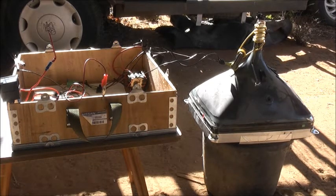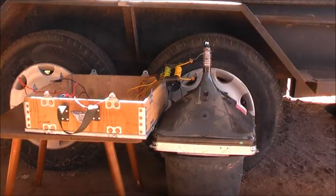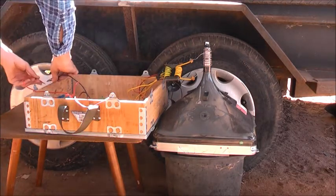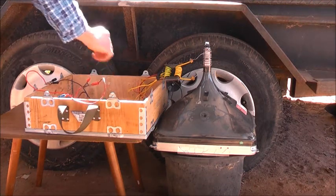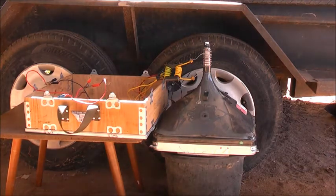It didn't work too well — it wasn't getting warm enough in that electron gun. Confirmation that it is working: it got quite hot on that screwdriver. So it's working okay, it's just taking a fair amount of heat in the CRT gun because of how it's designed — it's actually like an internal heat sink. So it's going to take a while. Cost of four amps though. Got to keep an eye on that flyback transformer so it doesn't get too hot.